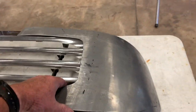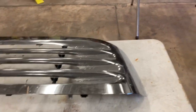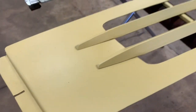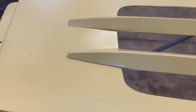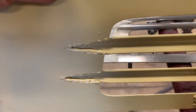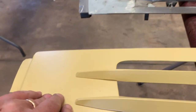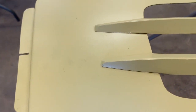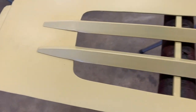Then I'll put that same design in the grill with these pieces of angle iron — it made a pretty nice little design. I just ground a piece of angle iron to a point and then welded it from the back side, so there's really no welds showing or anything like that. Water really can't sit in there because it's all welded tight.